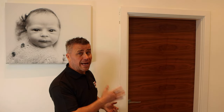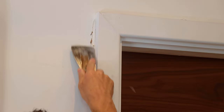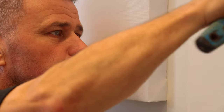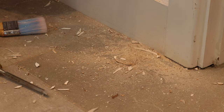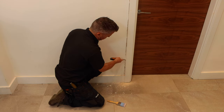The first step is to remove all that and clean it up. There are lots of different tools you can use for this — scrapers, old chisels, or even flat screwdrivers. It's important to remove any loose materials, whether it's old filler or cracked plaster. Scraping these cracks out deeper may look like you're doing more damage at first, but the deeper you can get, the more filler you can get in.